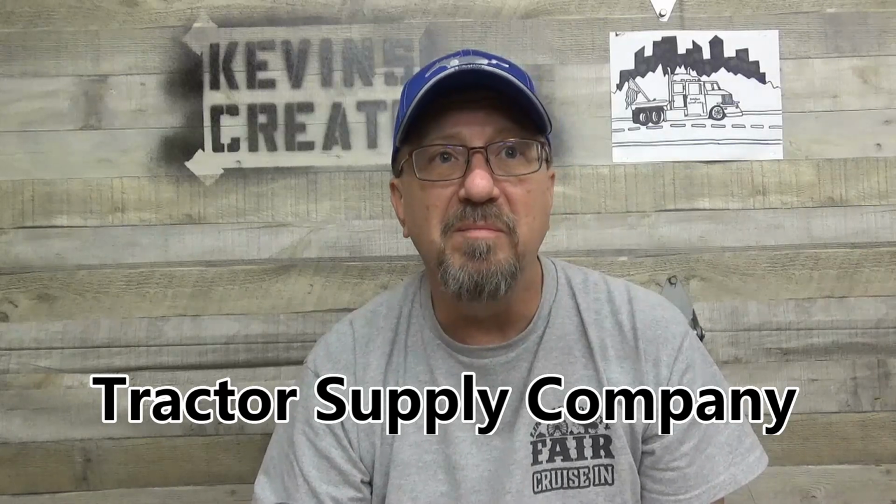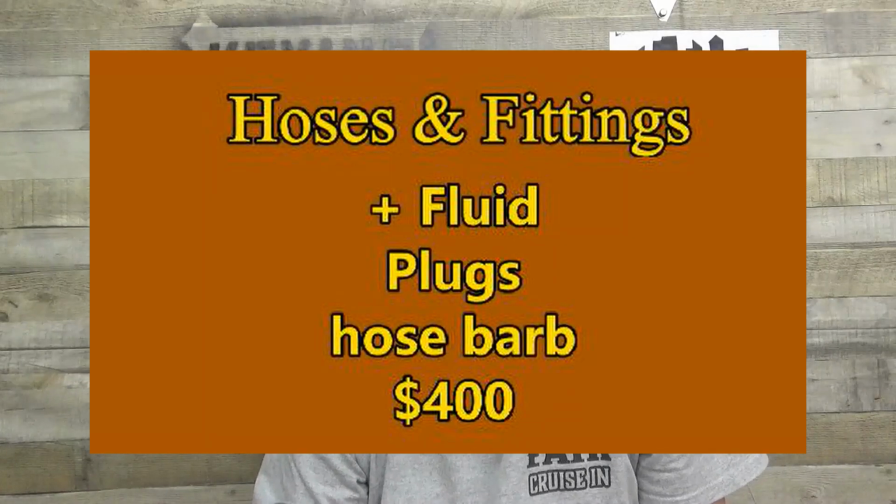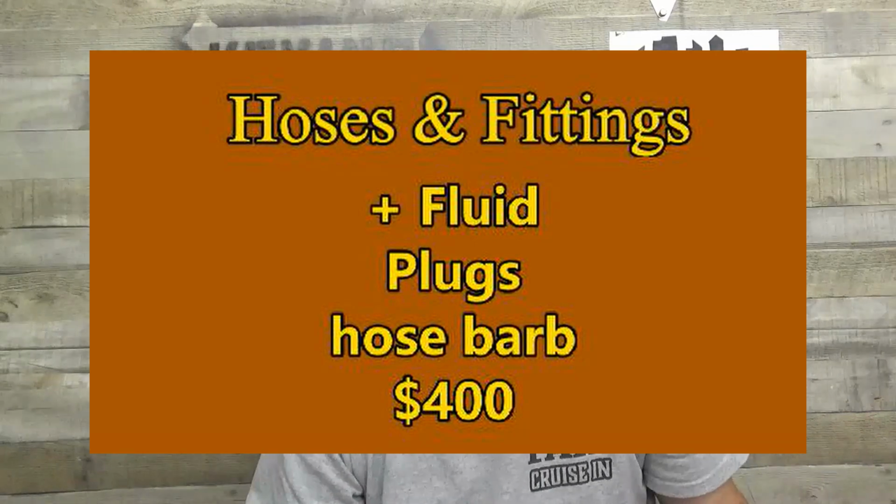I ended up getting some of the parts, the hoses and the fittings, from TSC. I did end up having to buy some of them on Amazon. I couldn't find anybody that had the T fittings that would tee off to go to two different directions, or to each side. And so all of those pieces, plus the fluid, some little plugs that I had to put in the original hydrostat where I took a cylinder out, and the little hose barb down on the back of the transaxle where I hooked a hose for the inlet hose. All of that was $400. And like I say, yours might be higher, yours might be cheaper on that. All this stuff is going to be variable in prices.